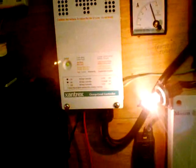I must get a better dump load than this, or find a way to actually put this power into something else. I hate to waste it — I've got about 12.5 to 13 volts going out on the dump load at the minute, so I've actually stuck a bit of load on the end of it to charge some stuff up rather than blow the bulb, because even though that's 110 watts, the panel might be kicking out 110 watts itself so I'm a bit close to the edge. Until I actually get about 500 watts going in, I think the resistance is going to be too high and that won't dump.